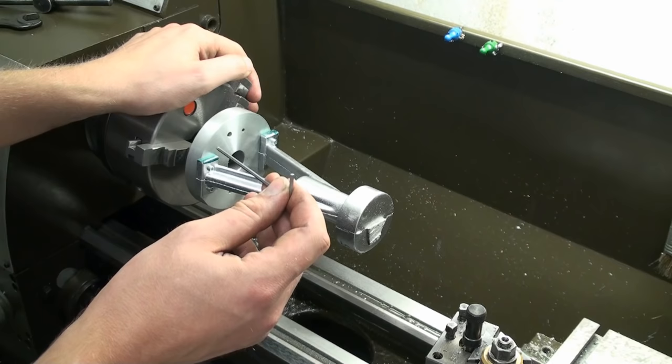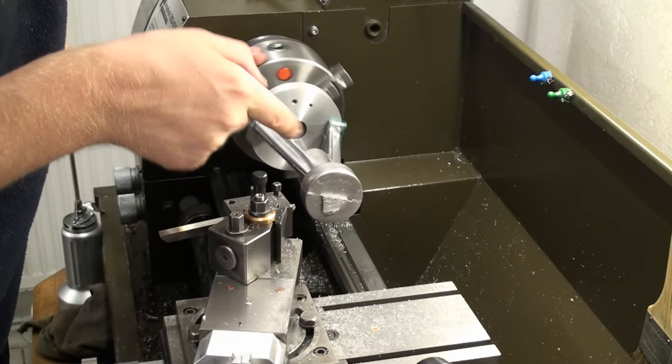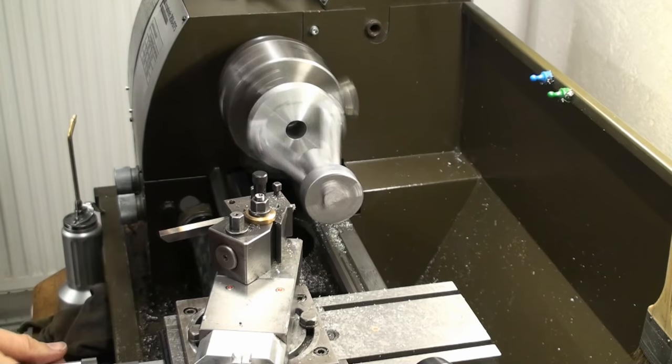And that was the cover of my lamp over the lathe. Okay. Okay, we will take a very careful face cut until we can get a centered bore or a center drill. A proper center, that's the right term. Let's see.